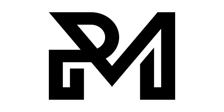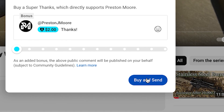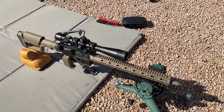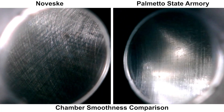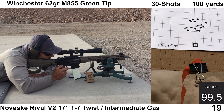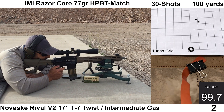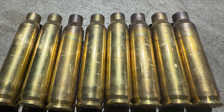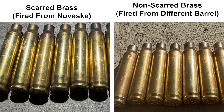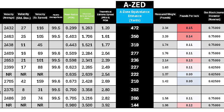Before moving on, I want to thank you very much for watching. If you enjoyed the content and found it useful, it would help me out a lot if you could tip the channel with a $2 super thanks so I can buy more ammo and equipment to help grow the channel. So wrapping things up, I thought the barrel had quite a few surprises. Everything forward of the chamber looked excellent — the rifling, the gas port, and the crown all looked phenomenal. However, the chamber and the barrel extension were not at all at the quality level I expected to see. The M855 group did better than I expected, but moving on to the Federal Gold Medal and IMI Razor Core, I was really surprised I wasn't able to get better groups out of those loads. With how good the rifling and crown looked, I really thought things would turn out a little bit differently. And then there's the scarred brass, which I feel is inexcusable for something that's supposed to have a hand-polished chamber. So that's what I got for the Noveske Rival V2. Let me know your thoughts in the comments below, make sure you're subscribed because I have a lot more content on the way. I'll see you next time.